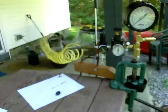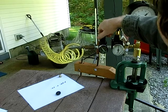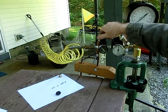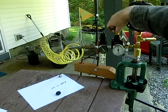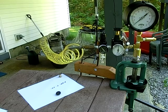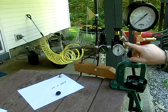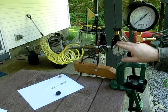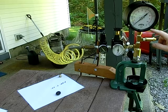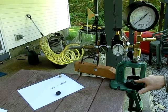Hook up the air supply. And we want this first regulator, I call it the secondary regulator, at 60 psi to start. The primary regulator, we're going to set that for 30 psi. So we have secondary reg with filter, primary reg, needle valve, relief valve. This will protect the air gauge if it becomes overpressurized. It'll release at 15 psi. We have our die, sub die, shell holder.